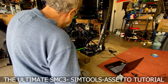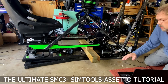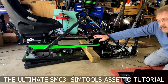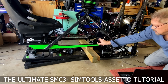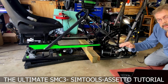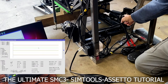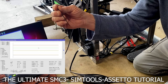You can put a level on it or eyeball it — I'm going to eyeball this one. It looks pretty level. When you turn your rig on it's going to pop up to this particular front elevation. All the weight is going to be on the U-joint with you in it, so you want it nice and stable. These two pieces of wood seem to work. Now we're going to set the potentiometers to read right in the middle. I put this on Motor 1 and the green line is kind of high, so I need to adjust the potentiometer.